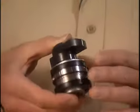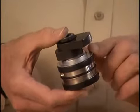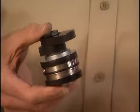On the underside of the motor, there is a patented feature which we refer to as our dust protection shield. That protection shield is protecting the double-stacked bearing on the front end of the motor from the contamination that is typically generated through the use of the sander.